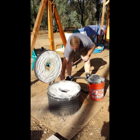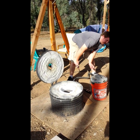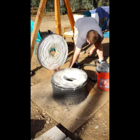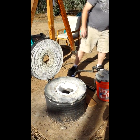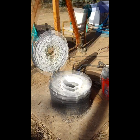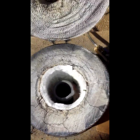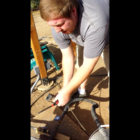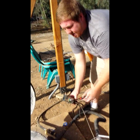Okay, so now we're going to light it. First thing I'm going to do is turn on the gas a little bit, and then stand very far back because I've already burned off my hair and my eyebrows doing this once. And I will just light the fire. There we go. Now I turn the gas on all the way and then turn the air on. You can't see it because it's daylight, but we have a nice little fire going. To regulate the airflow from the vacuum, I use a combination of this valve right here and a router speed controller from Harbor Freight. I can go straight into the airflow and make it hotter, but for aluminum I don't need to do that — I just leave it on low.